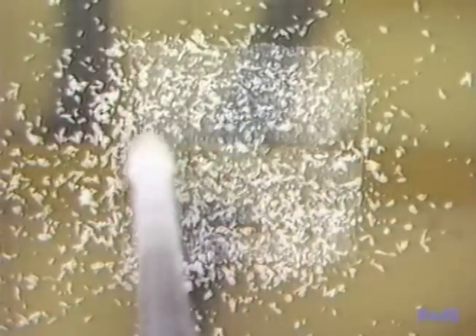Very carefully here — down a little bit, then out a ways, then down a little more. We don't want to risk nicking or gouging the conductor. We can tell how close we are by flushing the area with solvent to make it transparent.